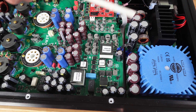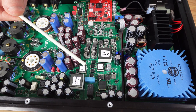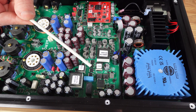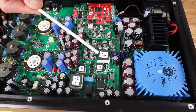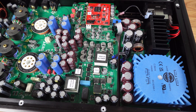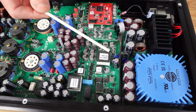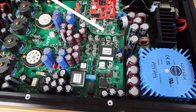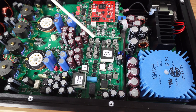In the DC-to-DC section, the 12 volts comes in and then gets converted to an AC waveform. We have multiple buffer stages to isolate certain sections of the power circuit, depending on where it's going — whether it's going to the digital module, whether it's going to the IV stage, or whether it's going to the analog output stage.